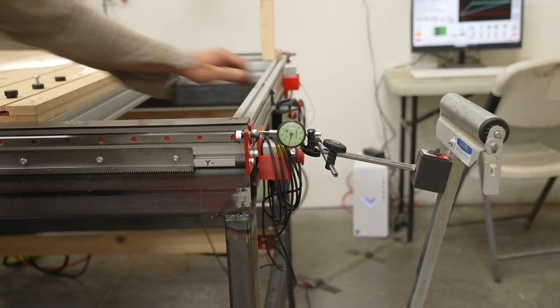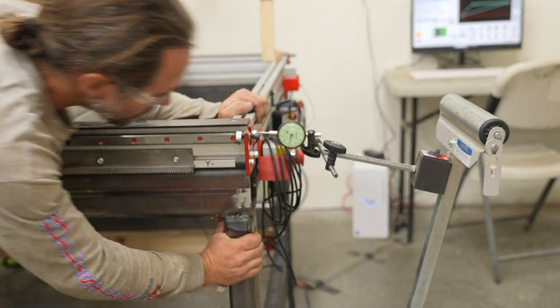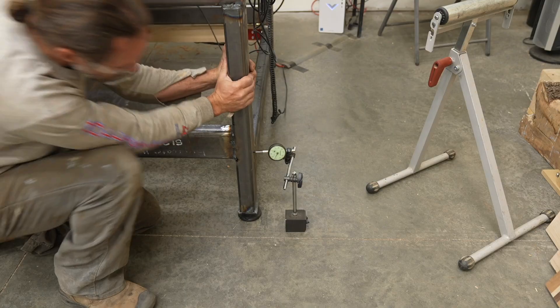I did some more indicator tests just to see how much I could move the table by hand, and I could move it about five thousandths of an inch. I'm not sure if this is just flexing the table or if I need additional weight added to it to prevent that type of movement. At this point I'm just going to use the machine and see how well it does, and if I want to improve it more maybe I'll try adding some more weight, some concrete, or I could just reduce the acceleration in Mach 4. So that's it — thanks everyone.